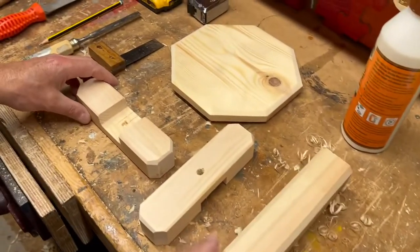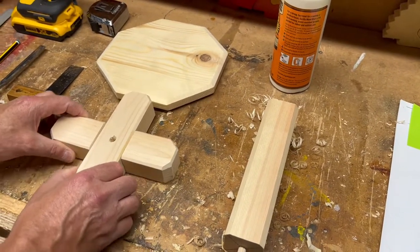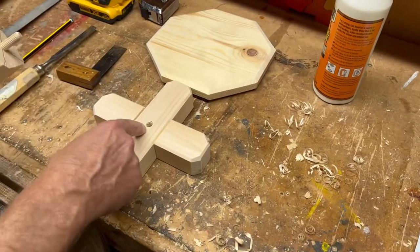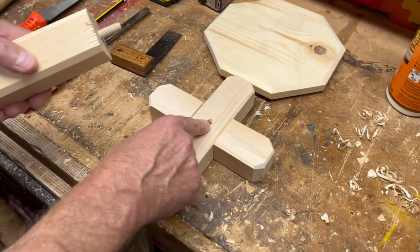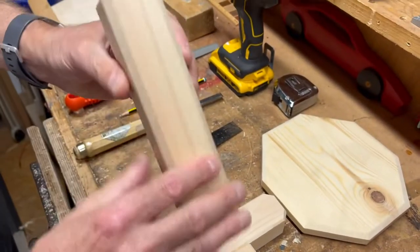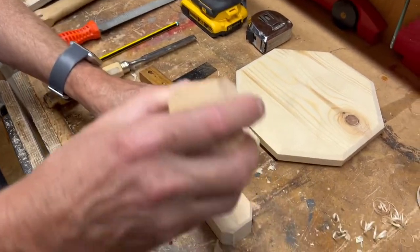These are the various parts and I've made it all out of pine wood. There's the lap joint — later video clips will show you how to do that. I've drilled an 8mm or 7.5mm hole there for the dowel, and there's the central spindle. I've sanded it and planed off the corners — it needs a bit more sanding actually.